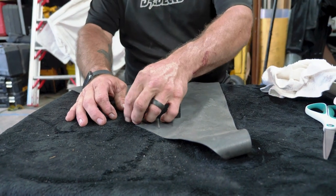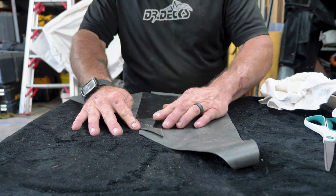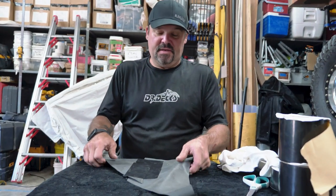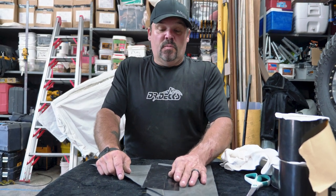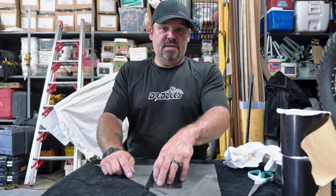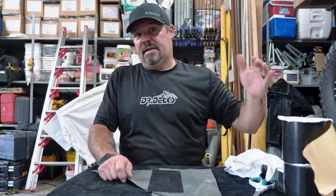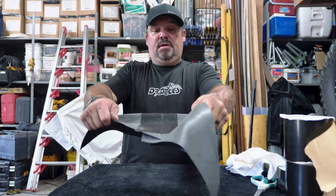It has the same inherent properties — if you put a wrinkle in it you can still pull it back; 3045 does peel back fairly easily but it's already starting to stick. If it's wet out it won't stick and you'll have to staple it to keep it tight. The reason they came out with this is because I was talking to the chemists at g-tape and mentioned we do a lot of EPDM pond liners. They wanted to make sure the chemical compound was compatible with EPDM — it was that important to them that they developed this tape specifically for that purpose.